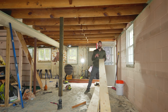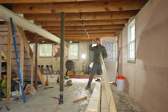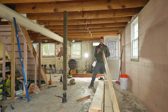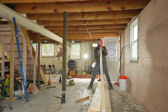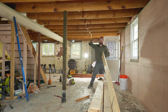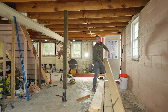When you're picking out your new joists, you want to make sure that both ends are bearing — that is the goal, to get both ends bearing. Joists are okay if they have a slight crown, which means one side bows up slightly, but you want that crown because that's the strong side of the board. You want that crown up towards the floor, so that if it settles it kind of flattens out a little bit. My crown is right here, so that is going to be going up.